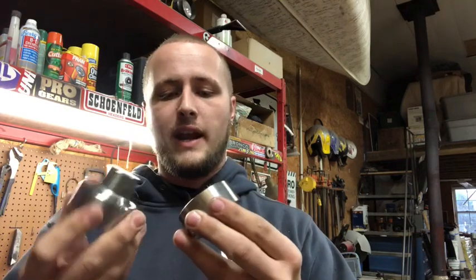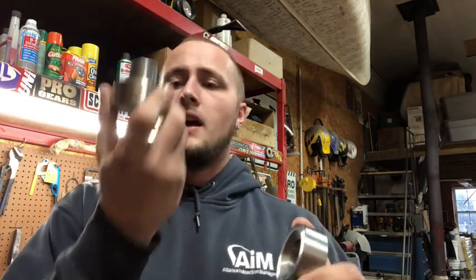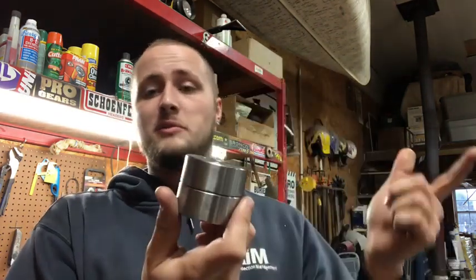So the press you're gonna need, because of the style that I own here, this dimple die, I only have one size right now, but this is about $30 or $40 on Amazon. And it's supposed to be able to do 1/8 inch thick steel. I don't really doubt that, but I'm only doing aluminum, so I didn't really care if it was a cheap one. This requires a press to sandwich these two.